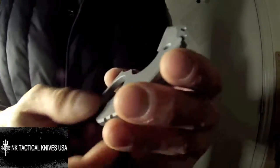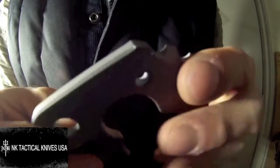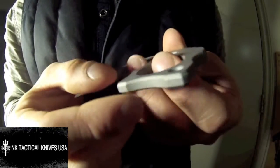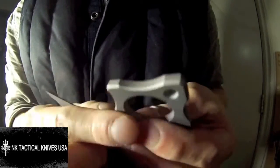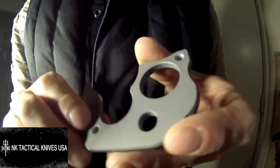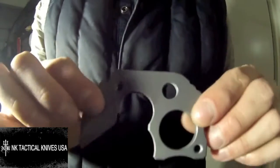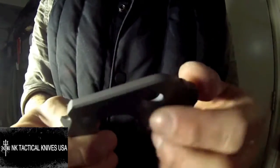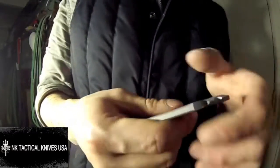The other issue is also the bevels. As I improve in skill, you can see each bevel is a very sharp, pronounced, clean edge along the knife. As each bevel transitions to the flat, it's very crisp, and it creates a corner that has a rough texture that is scraping too much. The best option is I'm going to have to stonewash this — just lightly enough to round off all those sharp corners. I personally think that is the most realistic option to preserve your sheath, unless you want me to make you more.